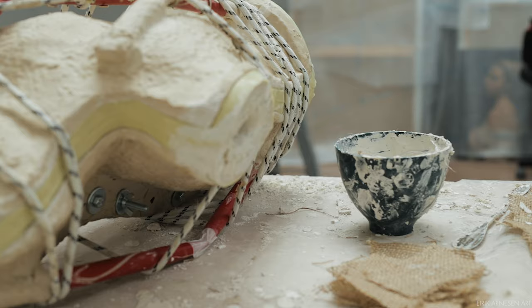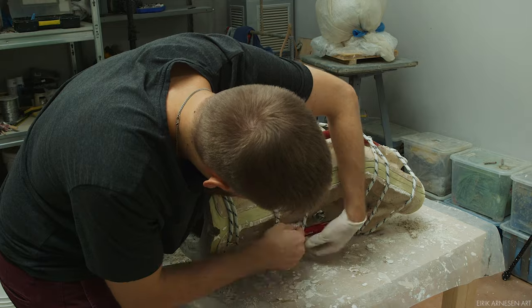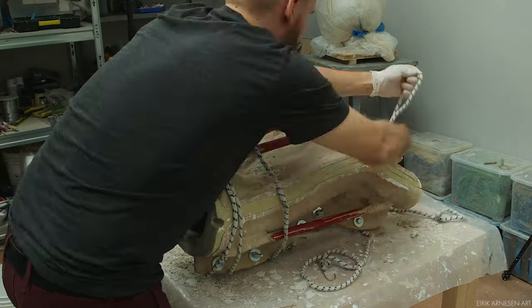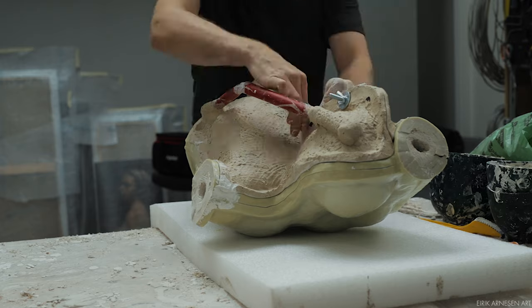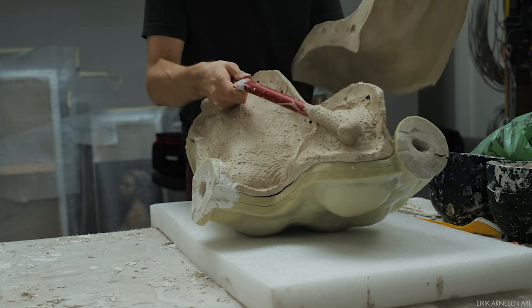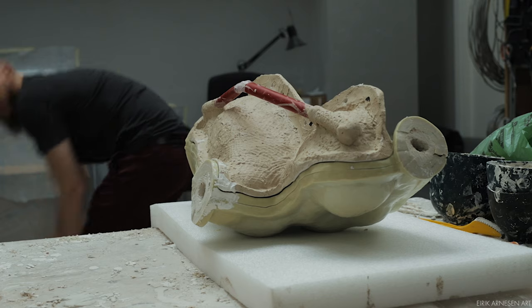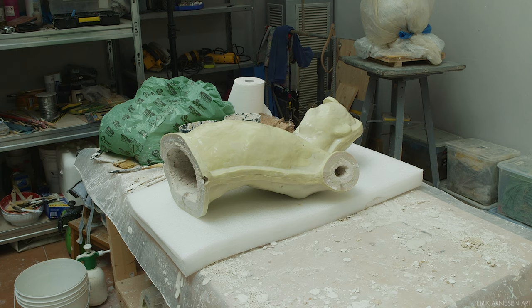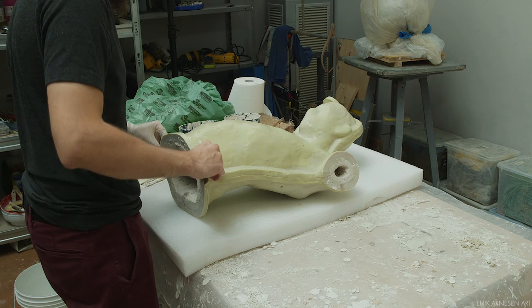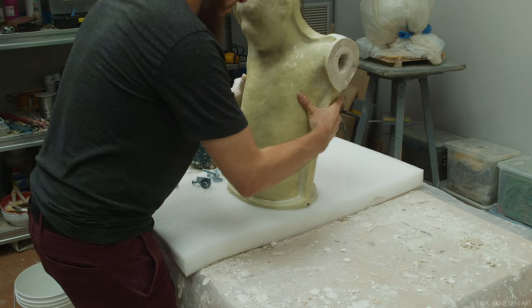So it's time for the most exciting part of mold making, which is of course opening the mold. First off, off with the bungee cords. Then, off with the mother mold. As you can see, I have a piece of foam that I can lay the piece down on so it doesn't lay straight on the hard table — a pillow or something similar can also be used. I know from experience making the mold and casting in it before that the silicone on the back should come off first. There's nothing potentially holding this piece on, so there's no risk when taking the back off. And with the back off, I have better visual access to the front, which does have parts which could be damaged when removing the silicone.